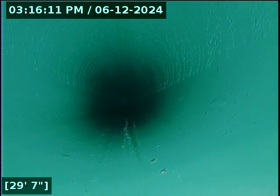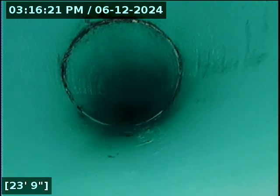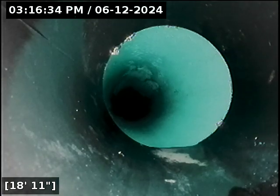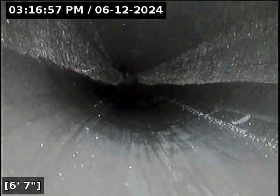That is one of those things though not a lot of folks think about. It's a very good idea to help mitigate grease buildup. Don't put it down the line. It's amazing how fast it can build up. I was just at a house here 2 months ago, 1.5 years old, not even a 2-year-old house. These people managed to get 2.5-inch thick grease buildup throughout every inch of the sewer line all the way to the main, so bad that my camera was scraping the top of the pipe. It was riding on that much stuff. So that's what you can accomplish in a short period of time if you're not being careful. Granted, I think they were dumping entire deep fat fryers down the line, but it just gives you an example. If you're just dumping your pans into the sink, it can build up faster than you think.